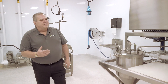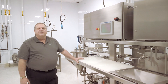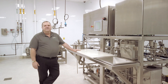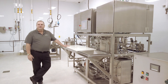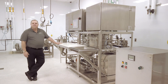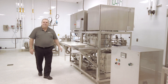Another piece of equipment we have in the facility is made by Cenobatec out of Raleigh, North Carolina. Cenobatec makes a continuous microwave processor, so it uses microwave energy to sterilize the food. We can do soups in this particular piece of equipment with particulates up to three-quarters of an inch. We also use this equipment to do sub-critical hot water extraction to extract natural colors, flavors, and bioactives.